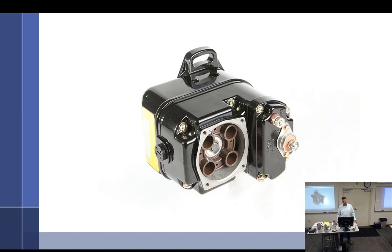Well, isn't that just like the Continental in the lab, because it's timed at 2830? Yeah, that one's that way because of uneven distribution. One side of it's leaner than the other side, and they kind of figured that out. So if we fire this one, then this one, it'll meet in the middle. Do you have to time the electronic ones? It's still going to run for the supplemental type certificate.